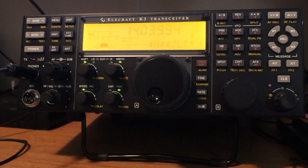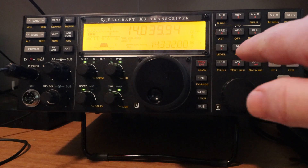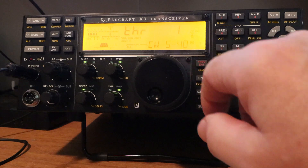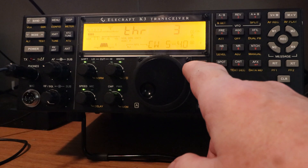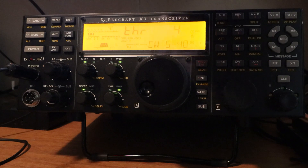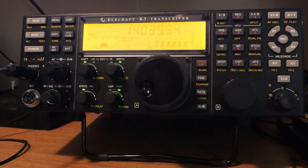In this video I'm going to show you what I did. I'm using the same antenna — it's an inverted V — and I've got a coax switch between the radios so the radios will be using the same antenna. I've set the radios to the same bandwidth. Neither one has noise reduction or noise blanker on; however, I do add those in a couple of times so you can see what they sound like. On that point, the 7300 is superior to the Elecraft K3S — when you add a little noise reduction on the K3S you can really hear that mechanical sound, and on the 7300 not so much.